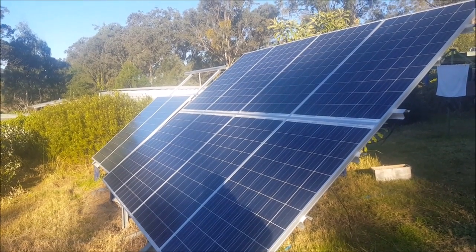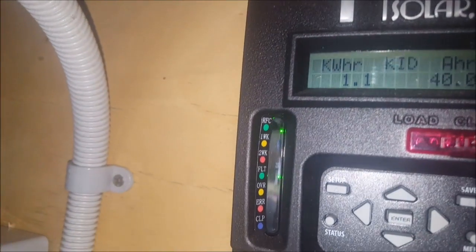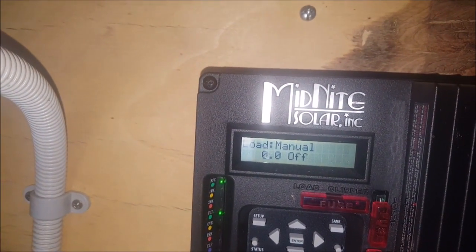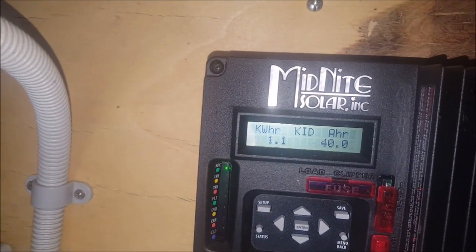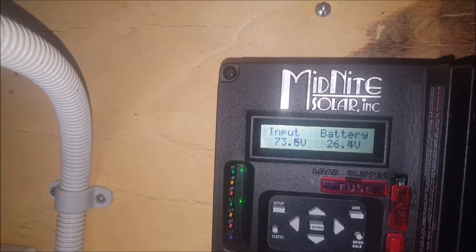Today's been beautiful weather — absolutely beautiful, clear skies. We've been working, killing sheep today — short sleeve weather, absolutely beautiful day. You can see my LEDs there — the top one received full charge in the last week, and they're currently at float. Only 25 watts coming in at the moment due to the shading. I've produced 1.1 kilowatt hours today, and the batteries are just over 26.4 volts.